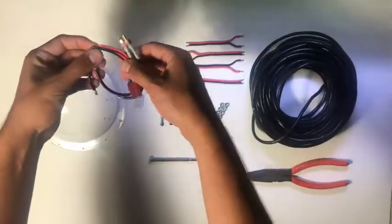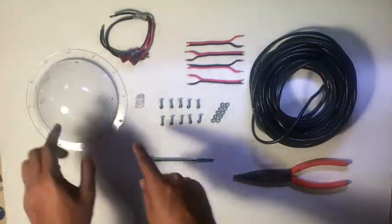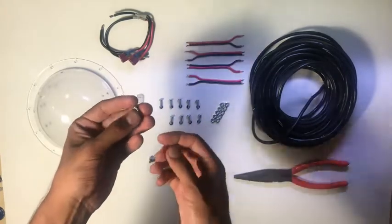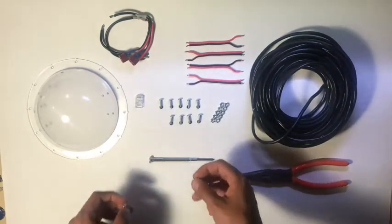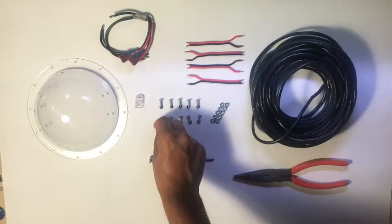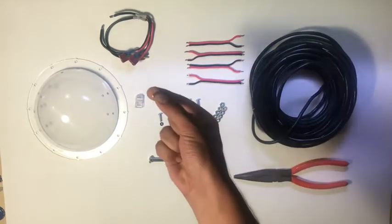We will also want a T-plug Y-harness with one male end and two female ends — I also cut the positive line for reasons we'll talk about later. To go through 10 of the paired holes we're going to need 10 self-sealing machine screws — half-inch 6-32 machine screws — and these little o-rings. The o-rings have an inner diameter of one-eighth of an inch and an outer diameter of a quarter inch. You can pick up a set of 10 at the Amazon link in the description. We'll also need 10 of these 6-32 nuts.